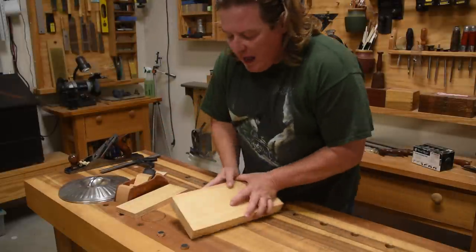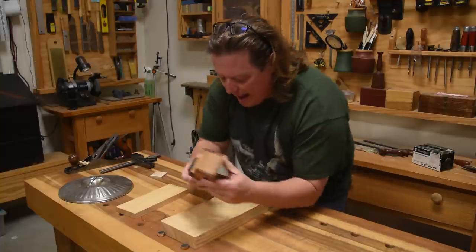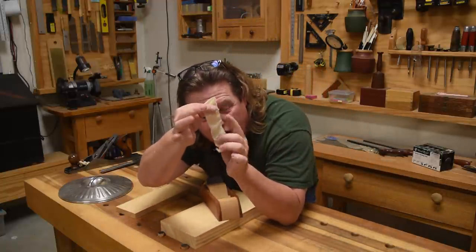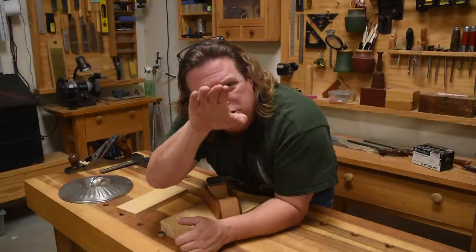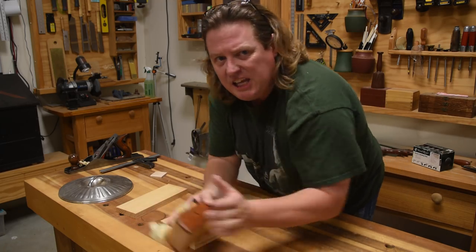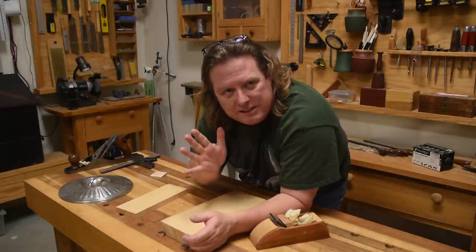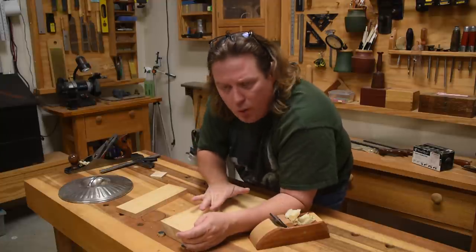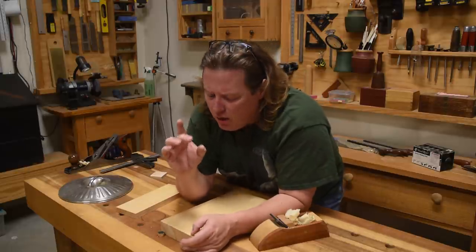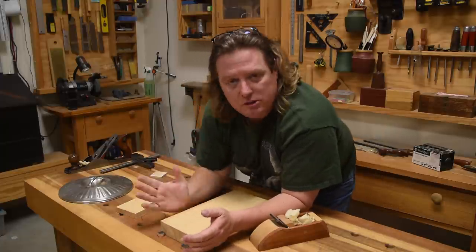When I'm smoothing a board, I keep my wooden smoothing plane set up with a slight camber also, because as you're smoothing stuff out you'll find a slightly thicker shaving in the middle. That creates ever-so-slight undulations as I'm smoothing off the top — a sensation you cannot feel. Whereas if I had a straight blade and I accidentally took one swipe more on one section than another, you would feel that rigidness; it's not a gradual transition. So even though the last smoothing cuts technically have a wave to them, you won't see it, you won't feel it, and the results will be a lot better.